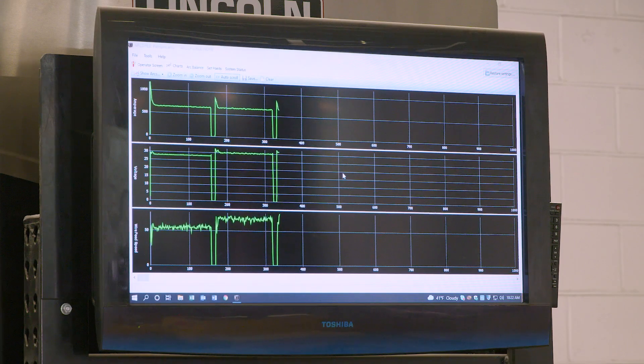Back over to Command Center, you can see our third weld farthest on the right — the same 650 amps of current, the same 30 volts as our second weld, and a slightly higher wire feed speed at the bottom. On this third weld we had approximately 1.9 meters per minute of wire feed speed, which is a 12 percent increase over the 1.7 from our second weld and a 34 percent increase in wire feed speed over our first weld. Note there is slightly lower penetration when using these settings due to the increased time in DC negative, but there's still a very low risk for lack of fusion.